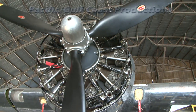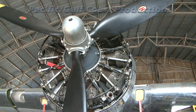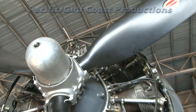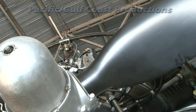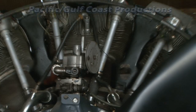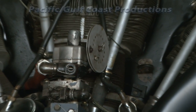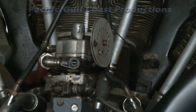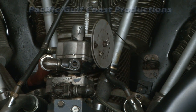In this particular case, the propeller is able to have a pitch change to match the engine with the load to the best RPM and manifold pressure for the flight condition. The prop governor on top is what the pilot uses to regulate the RPM of the engine, and the throttle is used to regulate the manifold pressure.